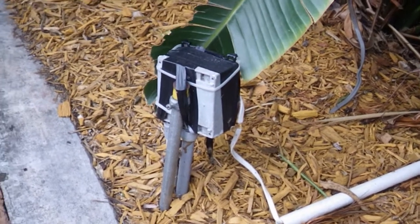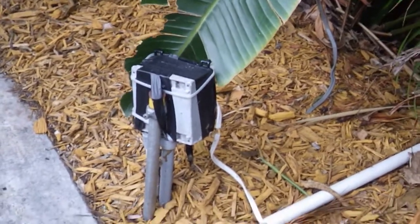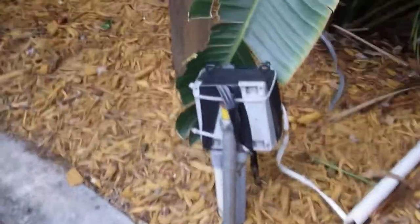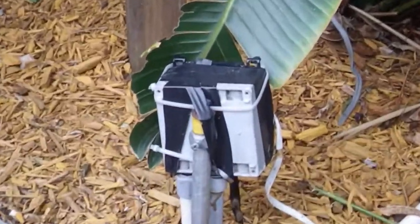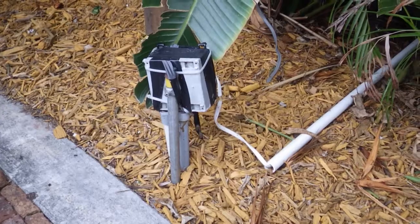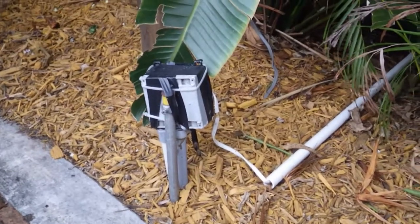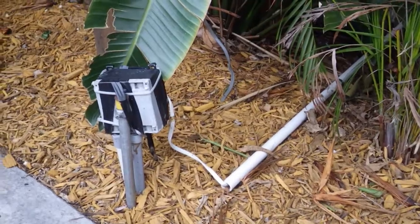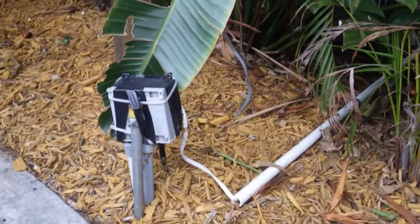Also, the box is broken apart. The cover's missing. It's wrapped with tape — probably an attempt to make it somewhat weatherproof. Broken box. Also, take a look: the PVC connectors are broken too, so the box is really just dangling there. That would be a violation of Section 110.12. You can't have broken parts — that would affect the mechanical strength of the box or its safety, essentially.